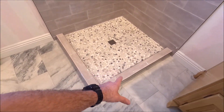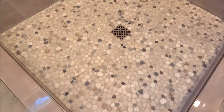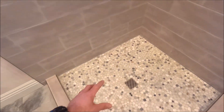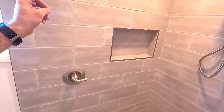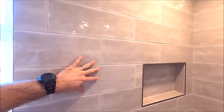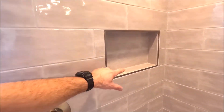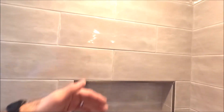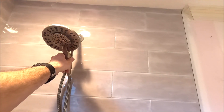Two-walled shower. Beautiful mitered curb. We have small format river rock cut flat. Beautiful Flow FX drain, body and grate. The finish on the Flow FX matches perfectly with our trim kit as well as our Schluter Jolly trim. Installed on the walls is a 6x18 ceramic, wavy, high-gloss, beautiful ceramic tile, 50% offset, full tiles at the bottom, full tiles landing at the bottom of the niche. We continue our layout and pattern behind the niche and full tiles above. Valve is on the left side, shower head is on the right. New valve and shower head installed as well.